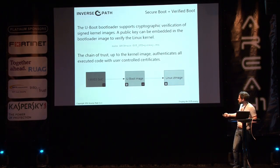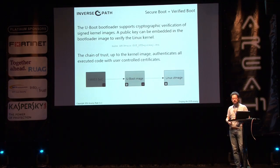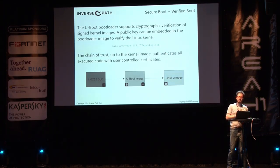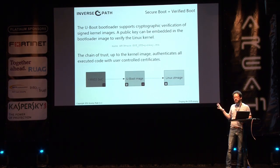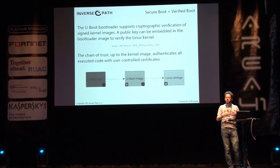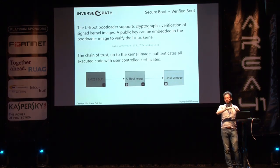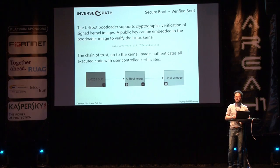Now, of course, in the system on a chip, there is an embedded binary blob which performs this operation. And one of the issues that is always raised is that you cannot inspect or read this binary blob. You don't know what's the microcode which is inside the system on a chip. On this specific system on a chip, this binary blob is memory mapped. So unlike other chips, it can be freely read by memory. And there's also an effort by some people who reverse engineer it to understand if there's anything funny going on.